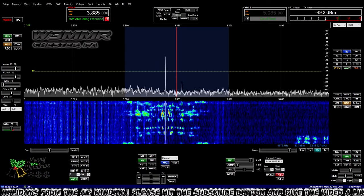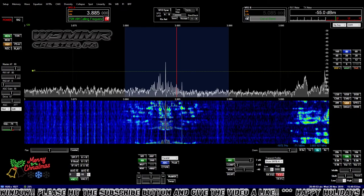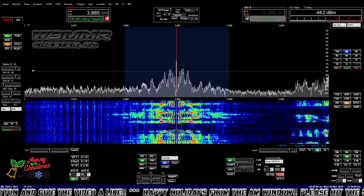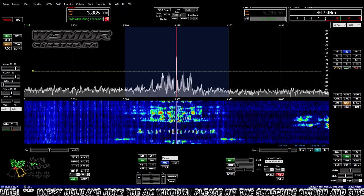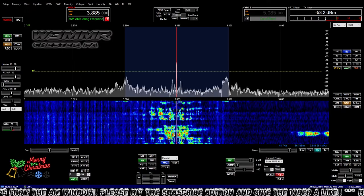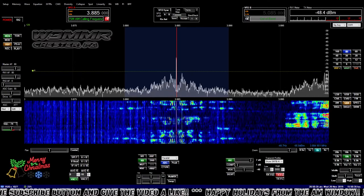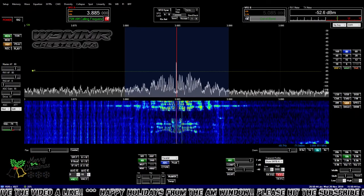The 3 dBs are typical measurement points, and when you go to the back of the array, the pattern is pretty much a big fat balloon all pushed over. But the back of the array — as soon as you go over the top and start coming down, it's not linear by any means. The biggest numbers on front-to-back — let me go to 45 degrees, other direction — and I'll tell you exactly what it is: minus 25.36 dBi.